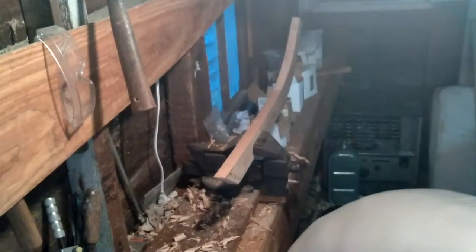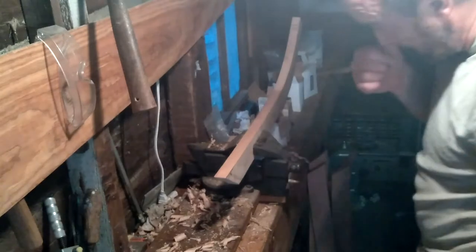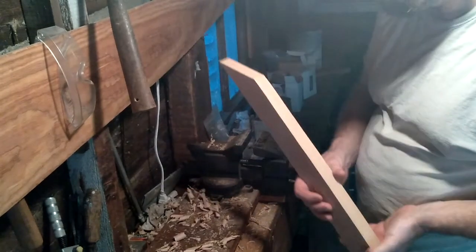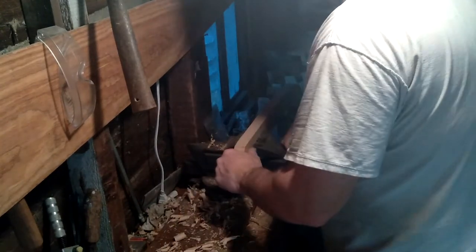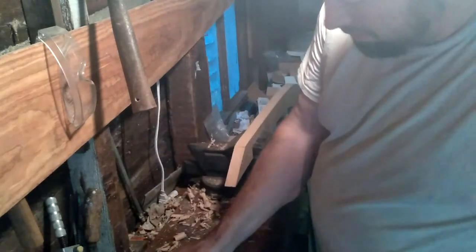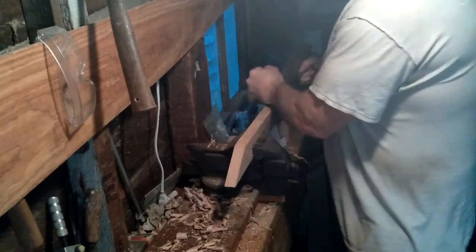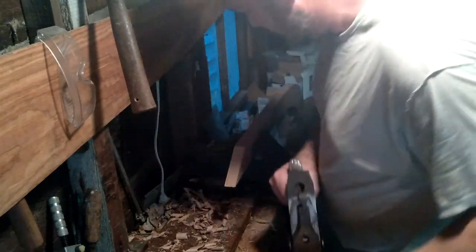So of course the angle of those half flaps is also going to be pretty important, because the angle those frames set in on really determines the angle of the sides of the dory. If one side is at a little bit different angle than the other, you'll end up with a wider boat on one side than on the other side, because the frame will lay out further and it'll push those planks out further. So you want to try and get them as close to the same as you can.